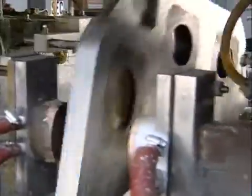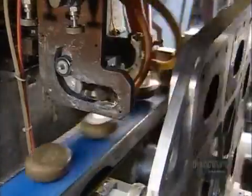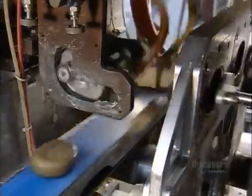The die rotates to accept the slugs. Mechanical presses move in to shape and stamp them. Mechanical arms suction the bars to remove them from the die. These mechanical pushers help. They nudge the soap bars out of the die towards the suctioning arms.